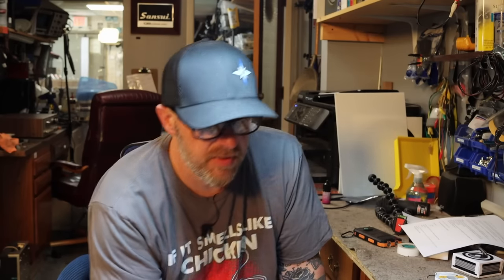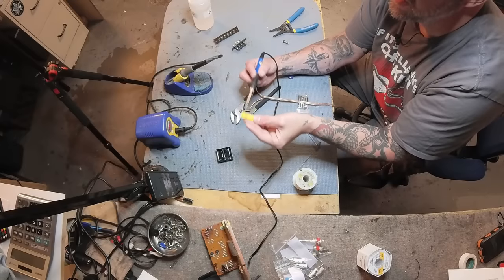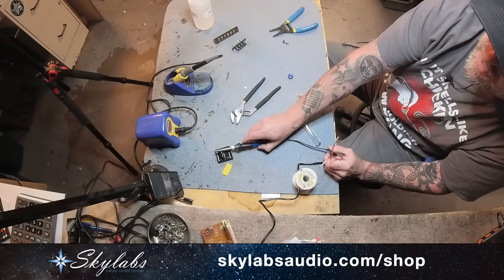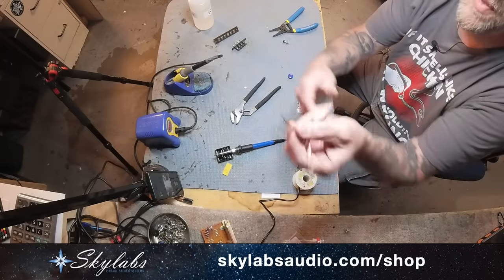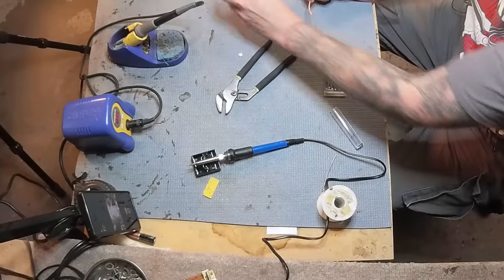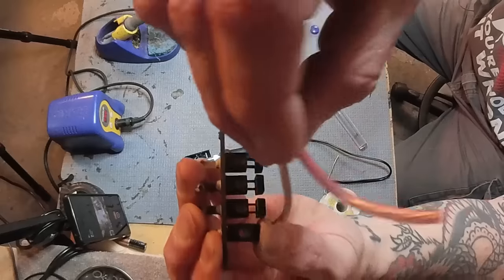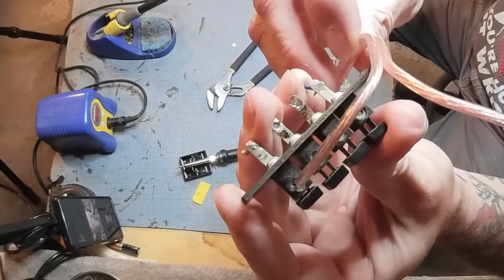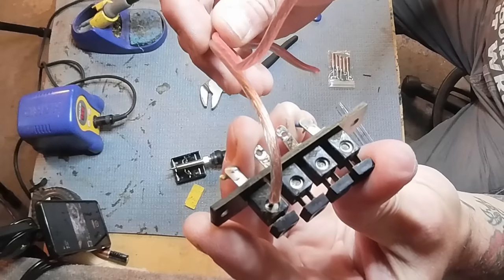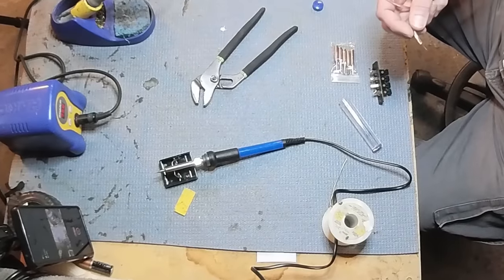So first thing: the solder in the kit is garbage — buy solder separately. The iron actually melted it pretty well. You also always want to clean your tip — that's what the sponge is for. Put some water on it and get the old solder off for a clean tip. Alright, we've got our first bit of wire tinned. Let's see what it's like putting that into the Marantz jack — it fits right in there, nice and secure. That's not going anywhere. No loose braids popping out. That's a good connection.